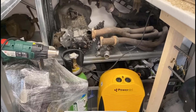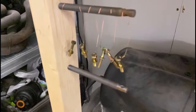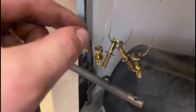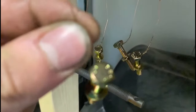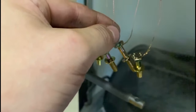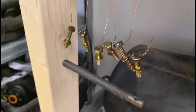The drying method isn't exactly orthodox — what I do is put a heat gun here and that goes straight onto the parts, which sit on a little rack I've drilled. They just sit there getting a bit of heat for about 20 minutes or so. As you can see the finish is pretty good. I'm very happy with them. The only thing to do now is leave these for a couple of days — you don't want to be touching them because the passivate is quite jelly-like until it dries off. The heat gun does help with that.